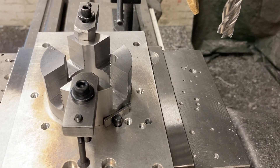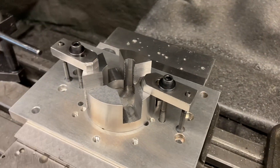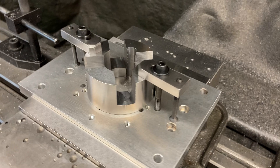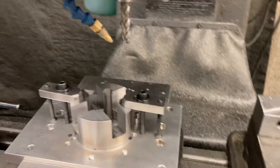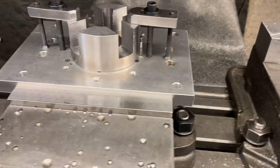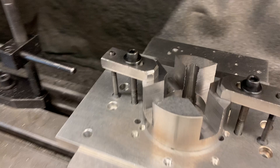For different sizes I use different shims, just to put it in the approximate location. The X-axis repeats really well — within a thou every time. Obviously the Y is gonna change because we're floating this way a little bit, so I clamp it down, put the indicator on it right here, sweep that in zero-zero all the way around, make sure we're good.